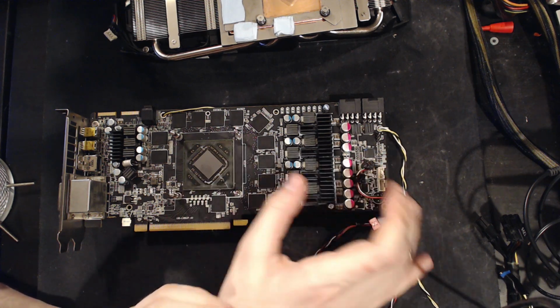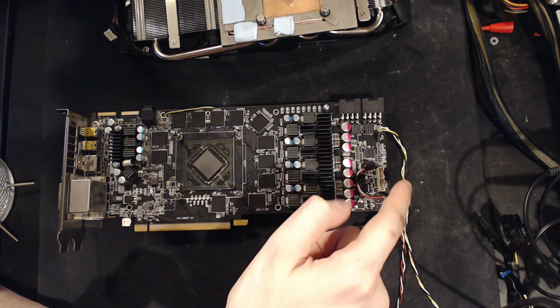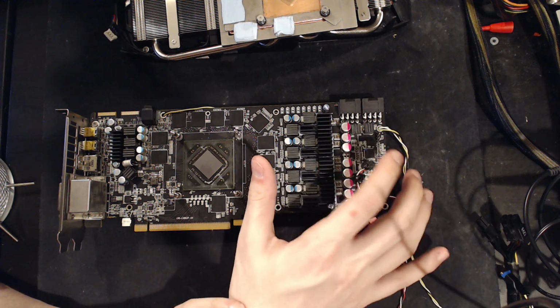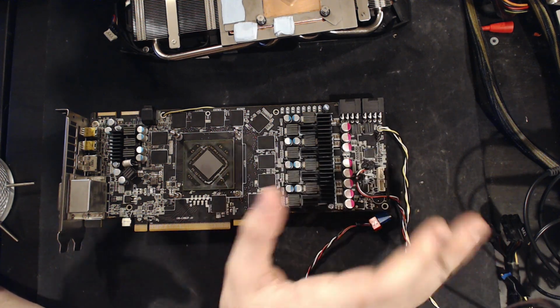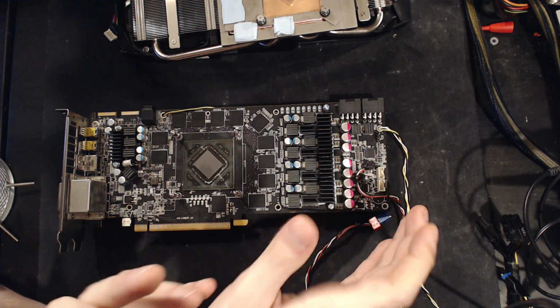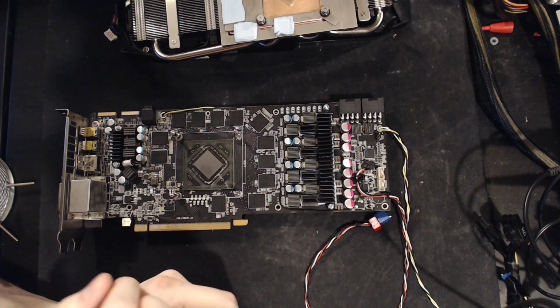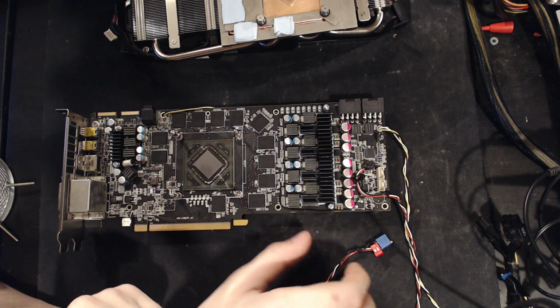So there's kind of a hard limit how high the resistance on one of these can go, and obviously if you put a 10k ohm resistor between this and the core, then you have a 1 to 2 voltage divider at the actual pin itself, which you don't want. So these are done without any kind of voltage divider between them, which makes them really hard to volt mod unless you start removing components. So remove the resistors and bam, we got voltage control working.